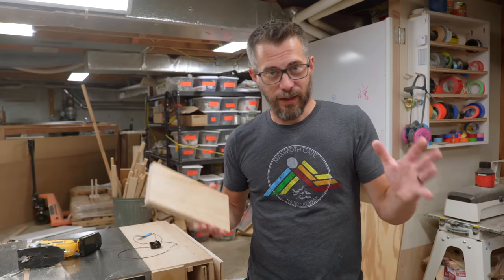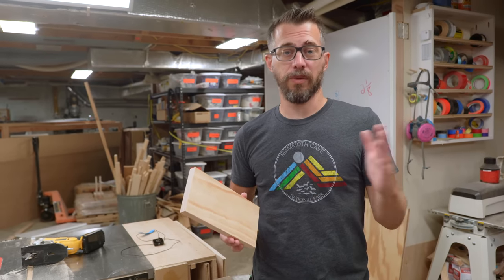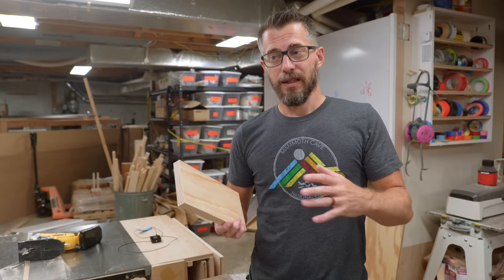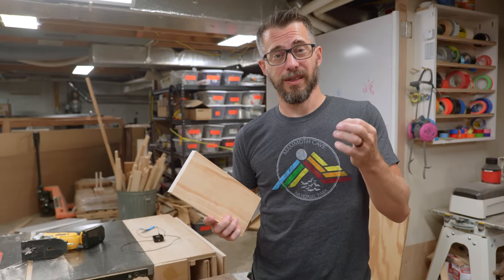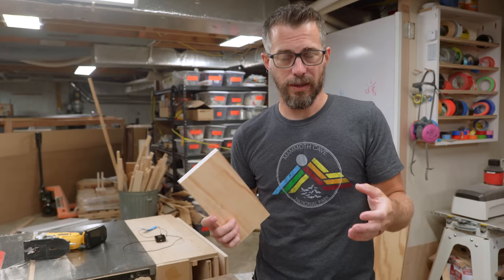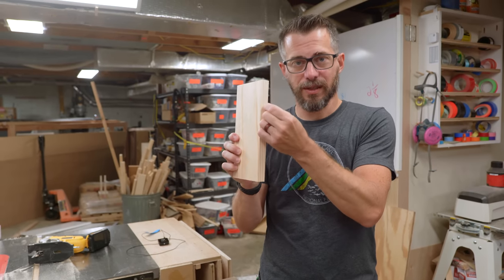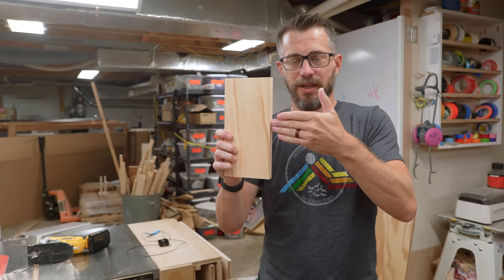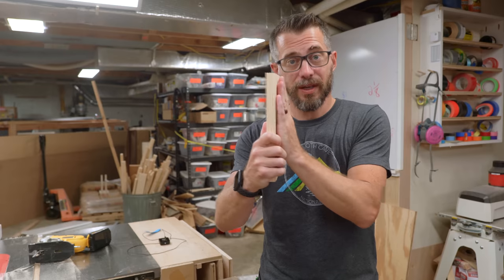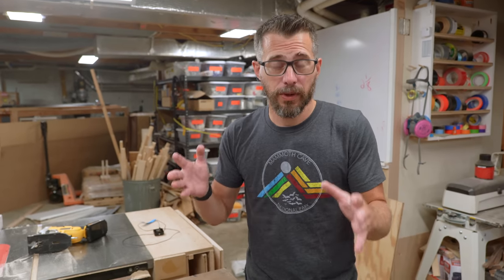We've got our big door thing made and we need to hinge it, because hinging it against a wall is going to reset all of the pins. So we need to attach it to the wall. It's got to hold the weight of the entire thing, but it also has to hinge a little bit differently than a door would. Instead of hinging off the back corner of the door, it actually needs to hinge off the center because of the thickness of the board. So we need to be able to hinge right here so that it will close all the way against the surface and reset all of those pins outward. So we had to come up with our own hinge.